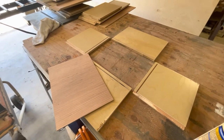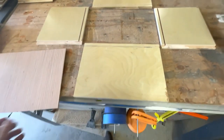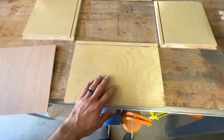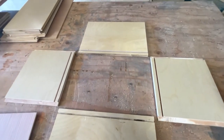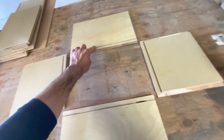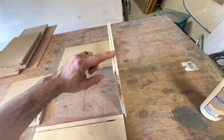Gluing up the drawers here. Just wanted to show you what I did to make them. Everything - all of the drawers - are going to be made out of half-inch birch ply that is pre-finished. Got a little boo-boo here, but that's okay. Just ran a dado through all of the bottoms and a quarter-inch rabbit on the sides.